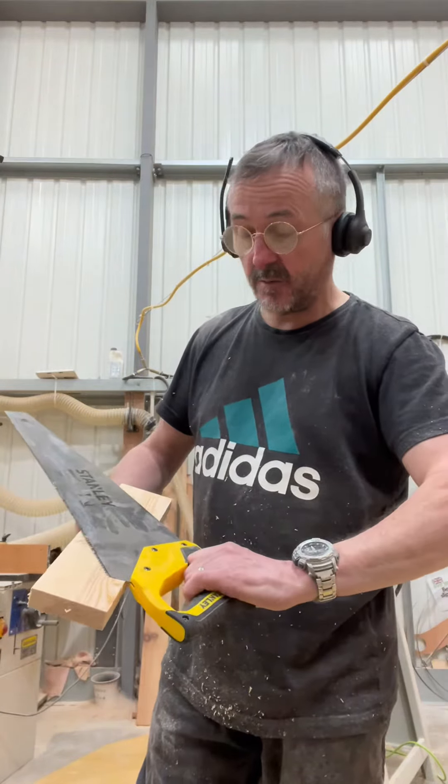You can get longer ones and shorter ones. I would recommend getting a good quality panel saw. You can get cheap throwaway ones but it's not very good for the environment and it's not very good for you because you're going to struggle — it's probably going to warp. Once they warp they start to twist and drag in the wood, which just creates a nightmare for you.